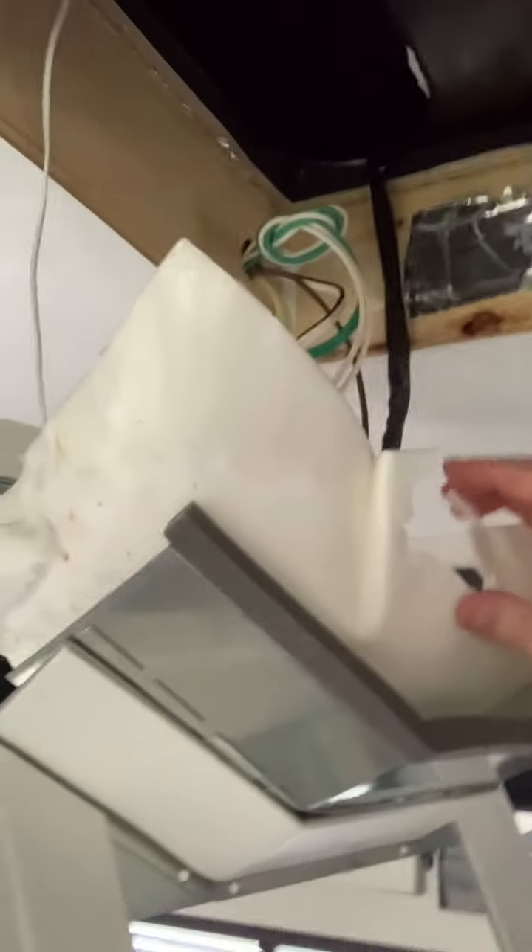All right, I've got it all taken down — I've just got the AC unit kind of hanging there. This foam-ish stuff here was separating the two spaces in there — the return and the delivery portion — so I'll have to touch that up, but it's just cheap stuff. I'll actually make it seal off a little better. As you can see, they've got a little bit of tape around those edges, but that's it. First I'm going to take this tape and wrap it — I'll show you that once I'm done — and then I'll put the Reflectix on.